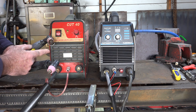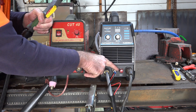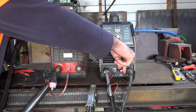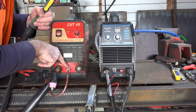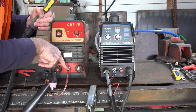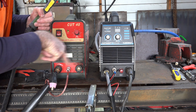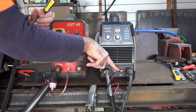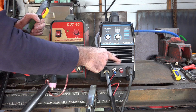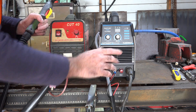All you've got to remember guys: if it's got a guide on it like this, and it has an extra connector on it like this — see this one here has an extra wire that screws on here, whereas this one here doesn't. This has just got the earth, and the on-off switch and the lead for the torch. But this one here has got the extra wire. The one with the extra wire is a non-touch plasma cutter, or a pilot arc plasma cutter.